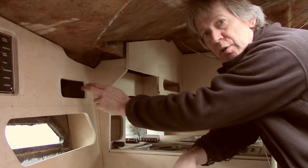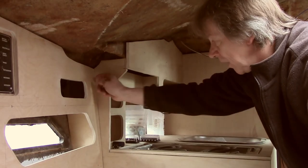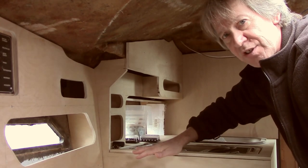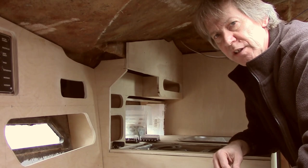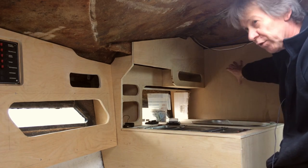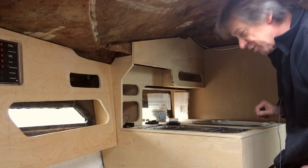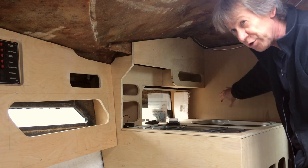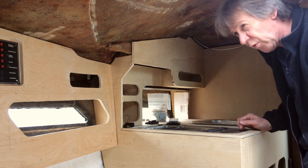The other thing I need to do with these cabinets is add proper attachment at the top — right now the cabinet is only attached at the bottom. I need to mark locations on the panel for blocking while it's out of the boat so reinstallation is more secure. Even the countertop is just sitting on top of the bottom panels held with quick-grip clamps — the whole thing is like a house of cards. Also, before I pull the panel out, I need to measure the space behind it to figure out clearance for cutting an access door and building a storage box in that empty space under the dash.